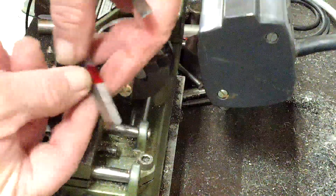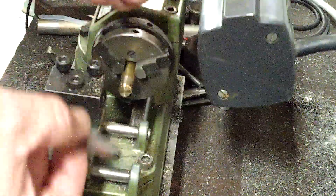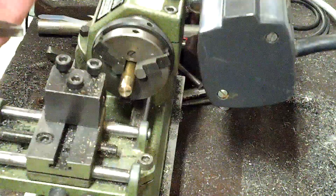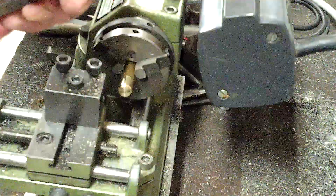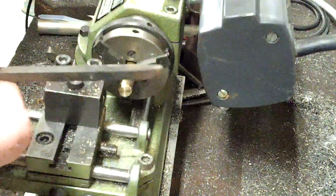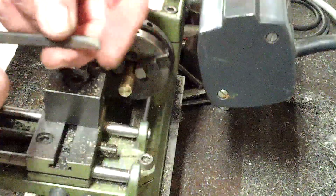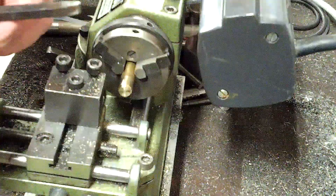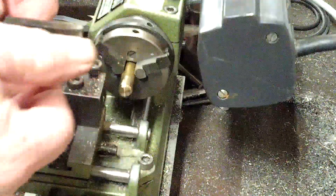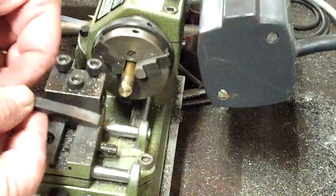What I've also done is made the rounded tool for the same purpose. It works very well on brass and it would probably work on bronze up to a certain point. I'm not sure — aluminum bronze might be difficult; it's difficult to machine on bigger lathes and may prove challenging. That may come up in one of these future videos.